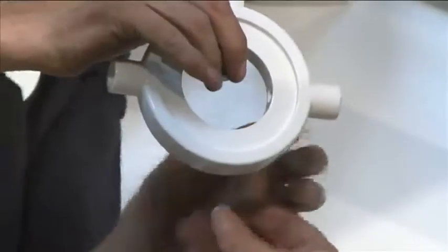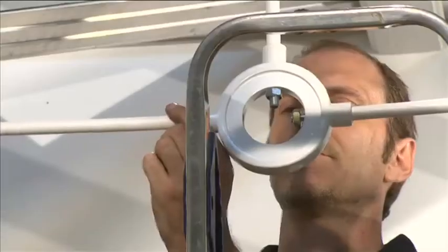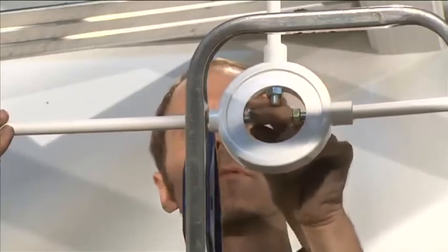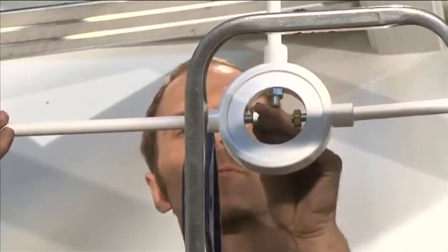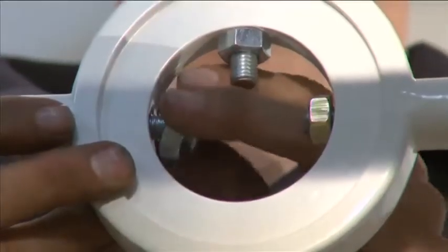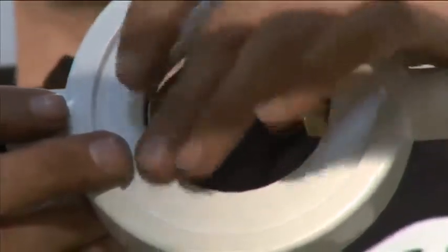With the vertical tie bar rod and the 2 horizontal tie bar rods in place, raise them all together towards the center and thread the ends of the tie bar rods through the holes in the 3-way tie bar center boss. Check the horizontal tie bar rods for level before tightening the M10 tie bar center boss locking nuts fully.